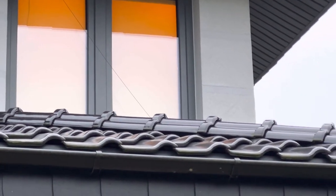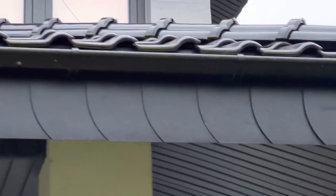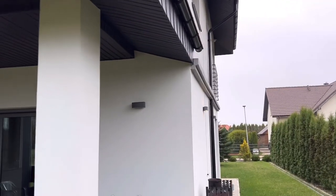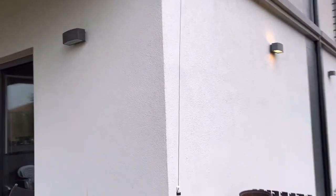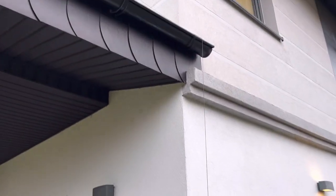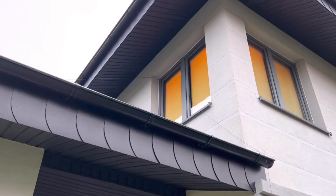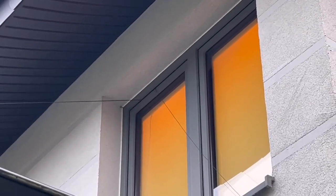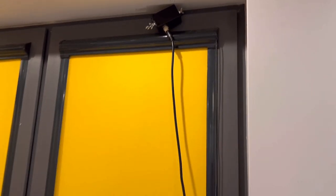It's a 17 foot counterpoise. I have it kind of hanging and dangling over the side here. I'll show you. Got an insulator on that as well. So there's the counterpoise hanging off the side there, 17 foot counterpoise. And there's the antenna up to the top of the second floor window, and up to the 9-to-1 unun at the top of the window here on the second floor.